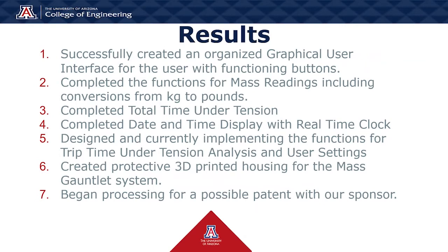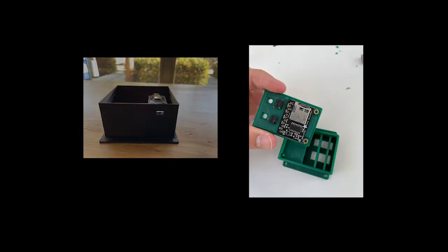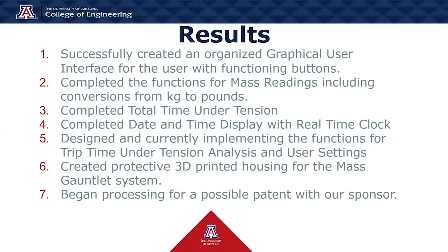In terms of the results, we were able to successfully create an organized graphical user interface for the user with functioning buttons, completed the functions for mass readings, including conversions from kilograms to pounds and vice versa, completed a total time under tension function, completed a date and time display with a real-time clock, designed and are currently implementing the functions for trip time under tension analysis and user settings, created 2 protective 3D printed housings for the mass gauntlet system, which was created for the TFT display and microprocessor, and we also began processing for a possible patent with our sponsor.